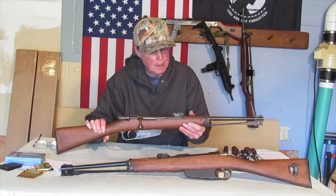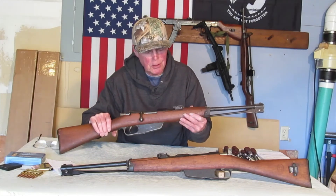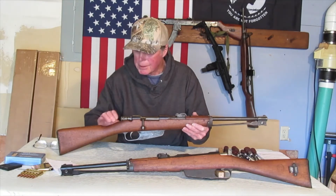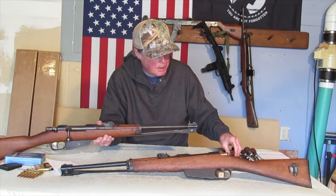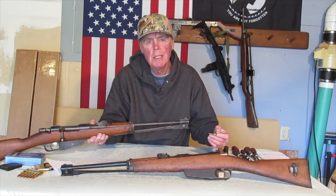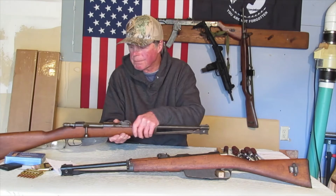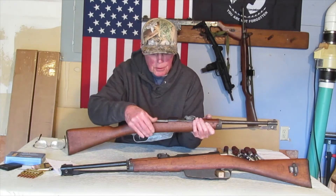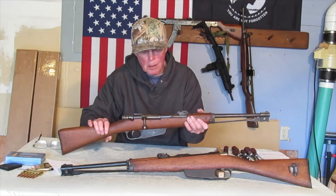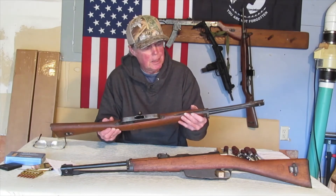I've got both of the Brescias put back together. From some of the close-ups, it's going to take a little bit of scrubbing here and there to get these things all cleaned up, get the surface rust off and the grease and everything. I did run a brush down the bore — there was a lot of cosmoline down there — and the bores look pretty good. There was a little bit of frost down there, but for a rifle this old they look pretty good. It doesn't swallow the bullet on either of them, so the muzzle's good. The action is good on both of them; it needs a little bit of cleaning and a little more grease, but all in all these are in excellent to very good condition.